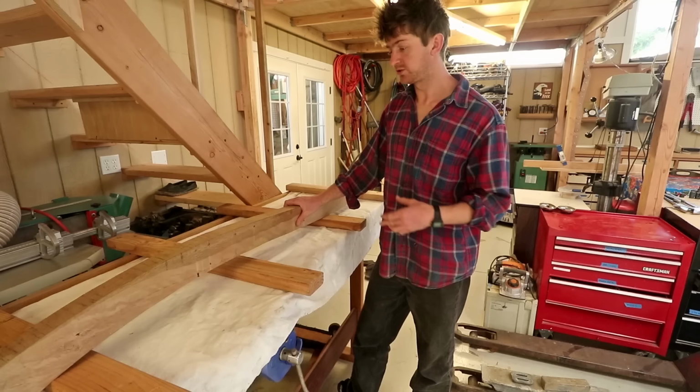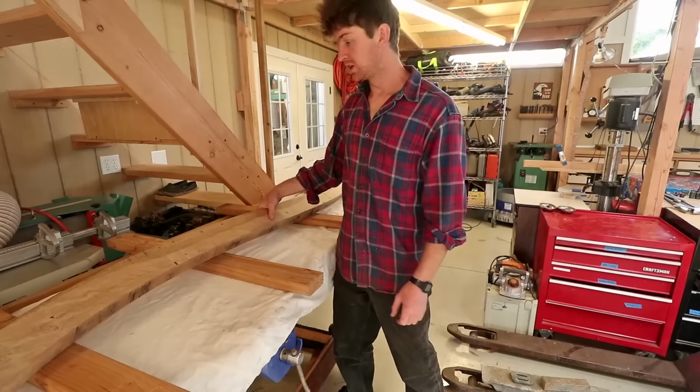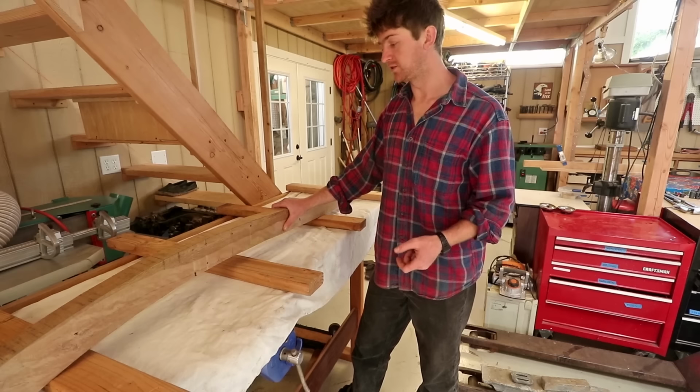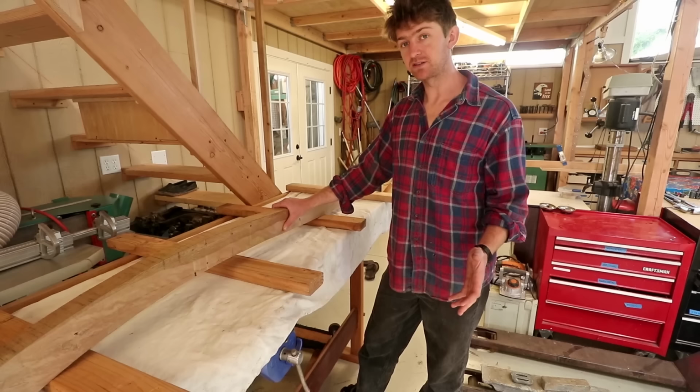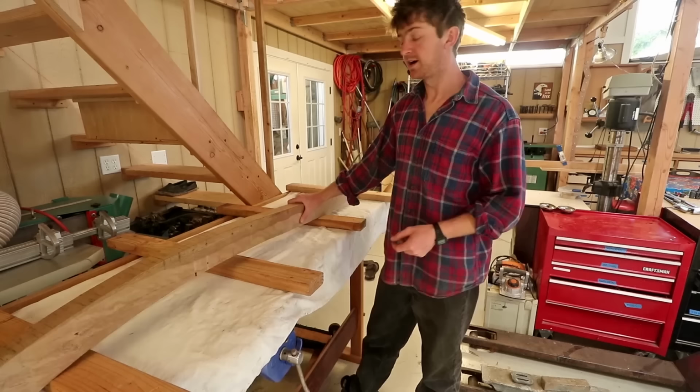You'll also see that on this futtock, I've cut it with a little bit of the wood near the edge of the tree, and that is usually called sapwood. So normally you would avoid sapwood because sapwood tends to rot away a lot quicker than heartwood. It usually is soft and not as strong. But one of the unique and amazing things about live oak is that the sapwood seems to be incredibly dense, strong, long-lasting and rot-resistant. Really no different from the rest of the timber. And in live oak frames that are taken out of very old ships, there tends to be no more rot in the sapwood than there is in the rest of the frame.